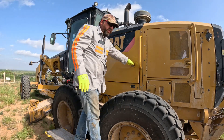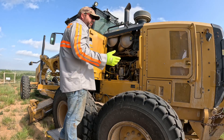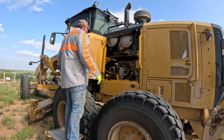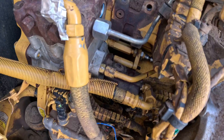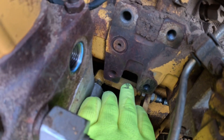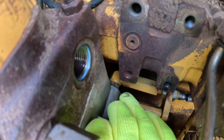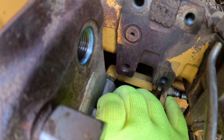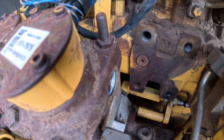We made a special tool to do this job as far as barring the engine over. I've found it's just as easy if you've got a big enough pipe wrench to fit over the crank pulley — bar it that way. As you can see, the fuel filter housing and stuff has already been removed. Courtesy of this fitting right here where it goes in — it's a 90-degree elbow. That fitting blew the threads out of the pump, so the whole thing just wiggles. Put a wrench on it right here where the jam nut is and the thing just wiggles when you try to take it loose. I tried to tighten the jam nut and of course it was just pulling the threads out the rest of the way.